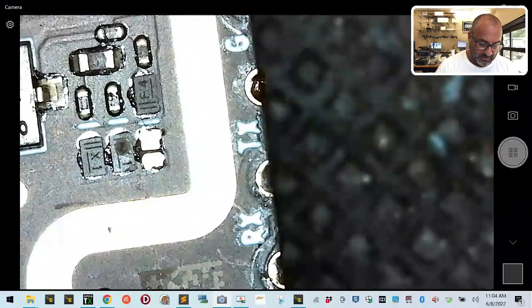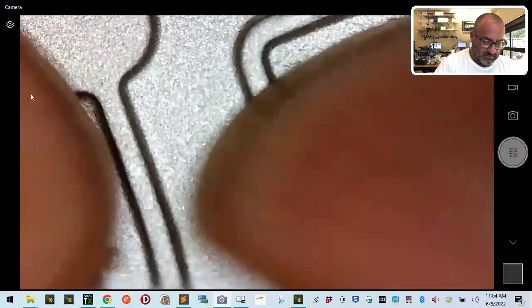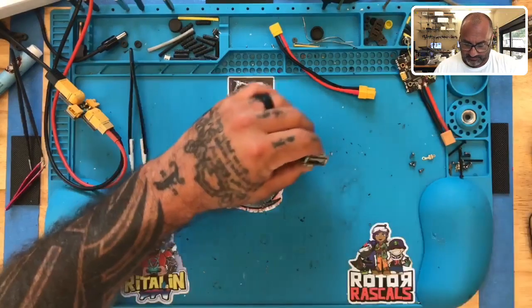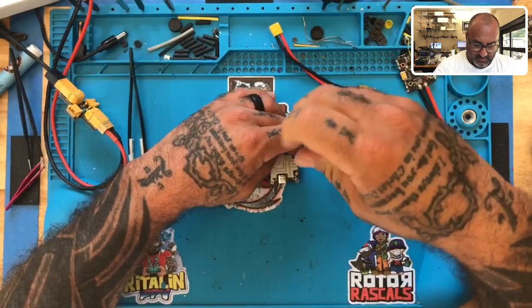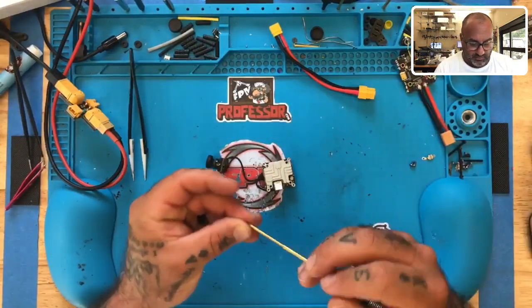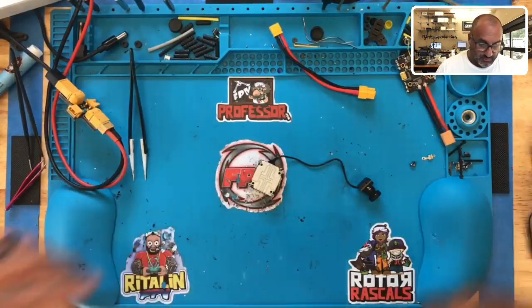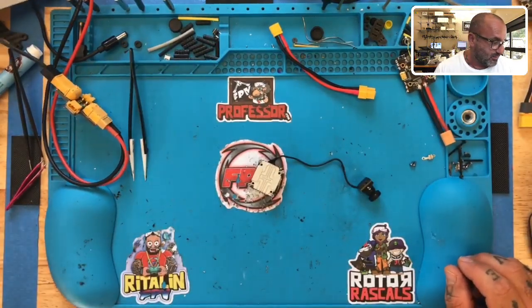We're going to let the board cool down just a little bit, then go ahead and put this back on. Now let's take the microscope out and get back to our bench. I'm going to put just two screws in here, something to hold it in place for the time being while we test the OSD. I'm going to be honest with you — it is something you can do at home obviously, but you have to be very careful that you do not heat up the rest of the components and end up pulling off everything. That is what I see most people do by accident, and that sucks.